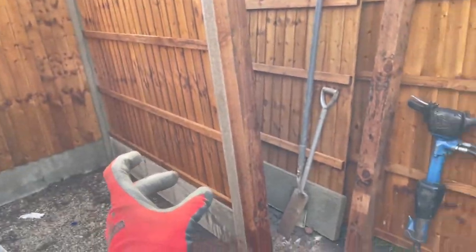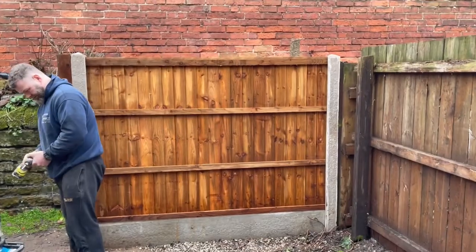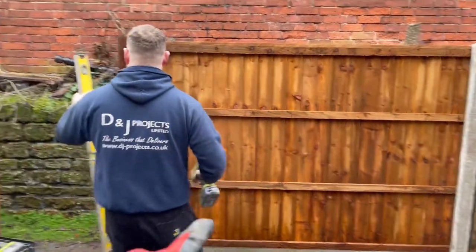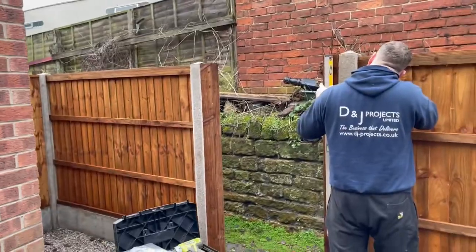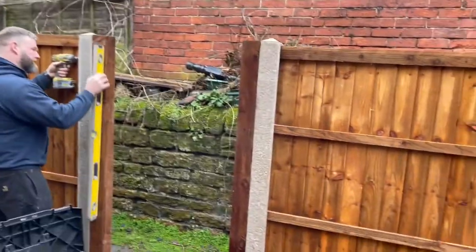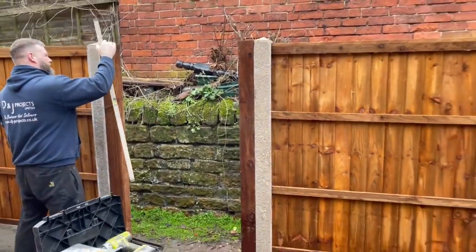We've gone with seven foot and seven foot here - I don't like doing it where you've got panel, panel, tiny panel, tiny panel, big panel. We're going to try and make it look nice and flush for the customer. It's the next day now and the fencing is all up - that's a six foot bay, seven foot and seven foot. We've given the posts 24 hours to set, put a few extra screws in for support for the gates to hang, which my dad's doing just now. We had the gate made custom and we'll get the hinges on and get this gate hanging.